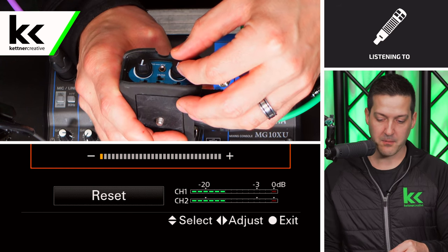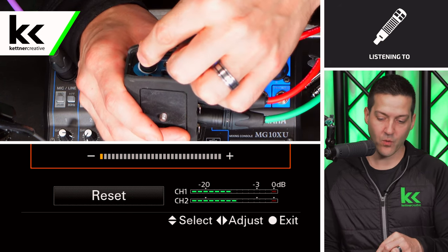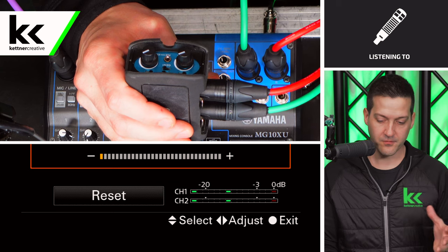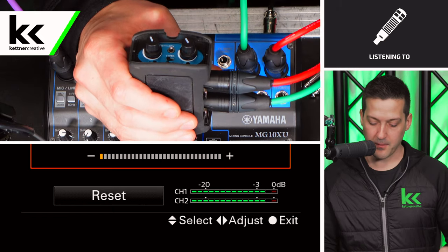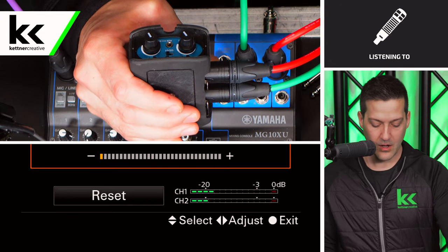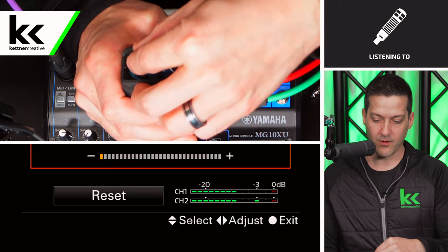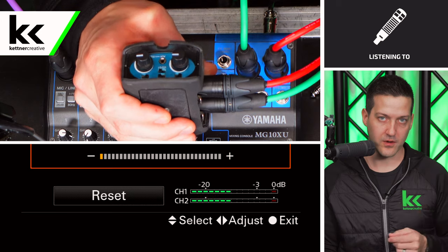You can see I'm coming in at about minus 10. I want my peak to be hitting the video camera at about minus 6 — I don't want to be getting close to that minus 3 mark. If you turn up this feed too much and get up past plus 3, it does get a little gainy and distorted. You want to keep this level down around minus 6 as your peak level. That gives you headroom so if something loud happens you don't get that clipped or distorted sound.